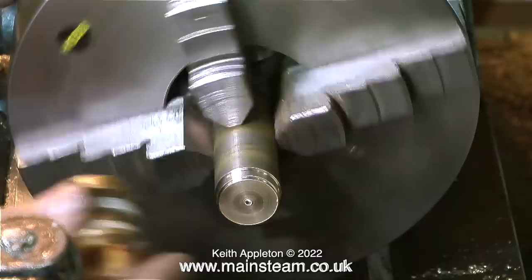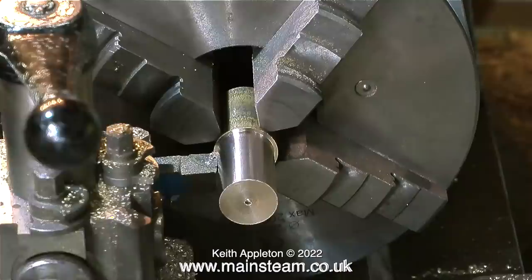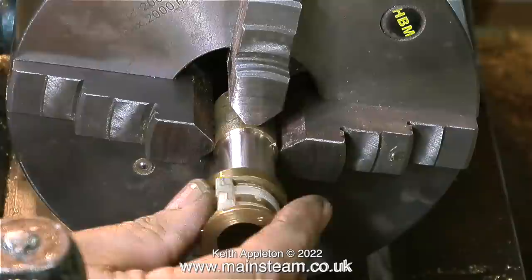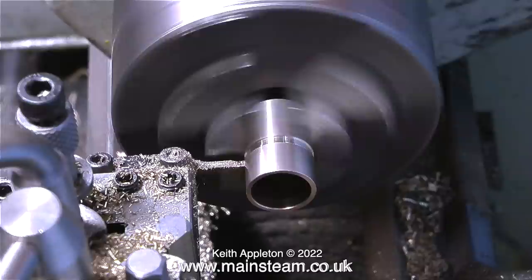To get the bearing bush to be a really good fit in the original bearings, I'm taking great care. I've fastened both halves of the bearing together with cable ties and I keep trying the original bearings on the piece I'm machining. By testing the size before every pass I can get a very accurate fit, and once quite close to size I frequently test it and will only take a full-length cut once I'm sure it isn't too small.